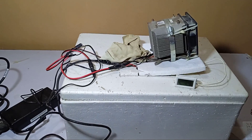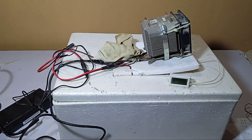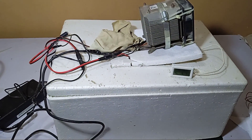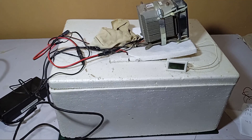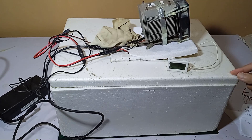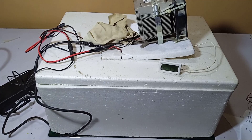It works really well in this setup. If we want to cool faster, we need to place around 4 Peltier modules to reach around 10°C within two hours. Running it longer might cool it further, but I don't think it will reach 12°C even running for five or ten hours with just one unit. The styrofoam box is a very crucial part of this experiment because it doesn't allow outside temperature in or inside temperature out, keeping the water stored in a safe, cool environment.